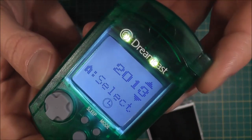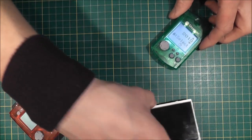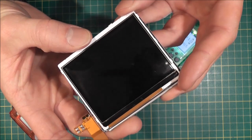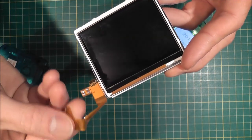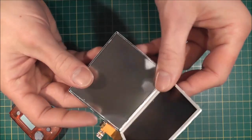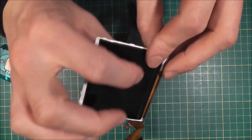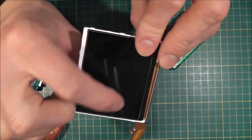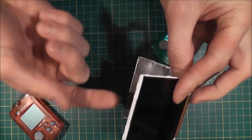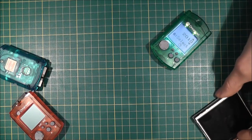To complete the mod I used the parts from a faulty Nintendo DS Lite top screen. This is the remnants of that screen here — it came out of an old console I'd repaired a while back. The ribbon cable on it had split so it was basically just junk, but I've taken the backlight module out of it. This section here is the main LCD panel and the backlight just sits here and shines light through that.